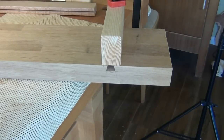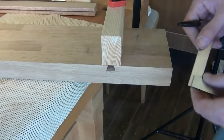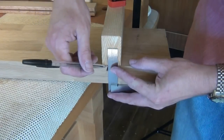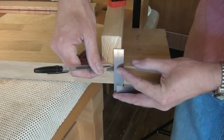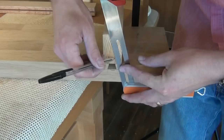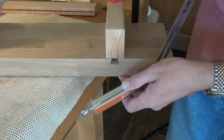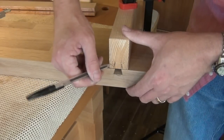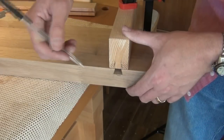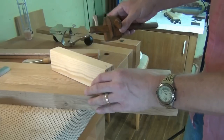To mark the dovetails on the feet, clamp the feet above the dovetail slot you've created, making sure they're at 90 degrees to the face of the board. Then mark up the dovetail widths up to the gauge line, which I've made on the foot half an inch from the base. Now use a bevel gauge to mark out the full shape of the end of the dovetail. Using a marking gauge, transfer the markings for the dovetail along to the other end of the foot.